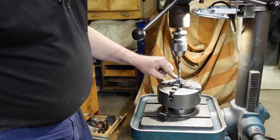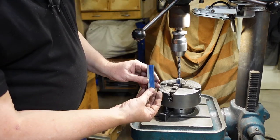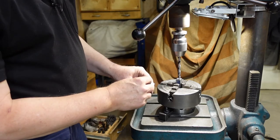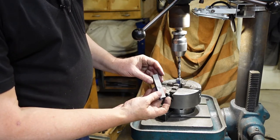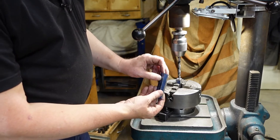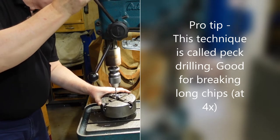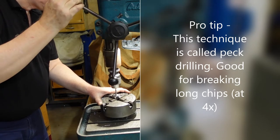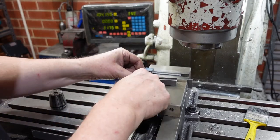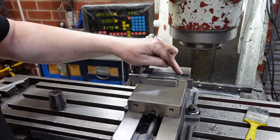That's the quarter inch block done — I've drilled the 9mm clearance hole in from the back and drilled the necessary hole for broaching in from the front, and I'll now take that over to the press and broach that square hole. On the 3/16th one I can put my 3/16th hole in from the front and just go back about 25 millimeters — the rest will get machined away so it doesn't matter. This is the 3/16th version: instead of drilling in and then milling away as with the quarter inch version, I've milled away and then put a trench in with a quarter inch cutter.